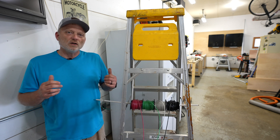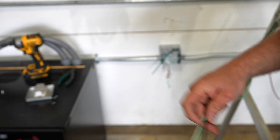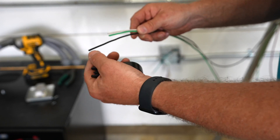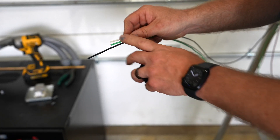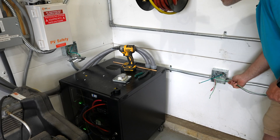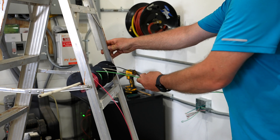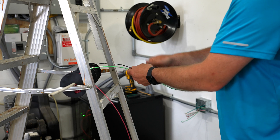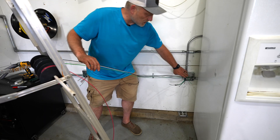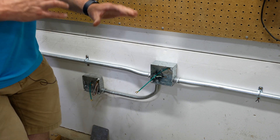If you're pulling wire through conduit that's very long or around a lot of bends, you'll definitely want to use some fish tape or fish wire. For the short runs I'm doing today, I'll just hand pull these straight through the conduit. To make fishing easier, I'll pick one line as the lead line — if using fish tape, bend one of these over to make a hook and strap the rest to it; in this case I'm just strapping them all together. I also want to mention that when pulling wire, it's important to set up some type of distribution system. I use spools with a dowel hung off a ladder, angled so the wire feed flows naturally into the conduit without twisting, making it easy to pull the exact length you need without binding.